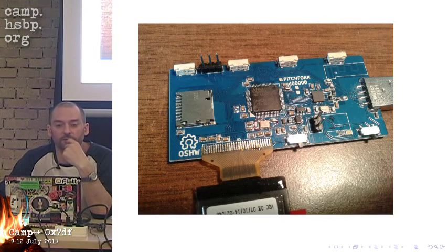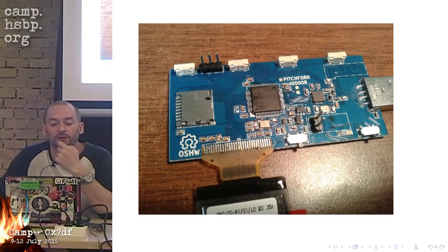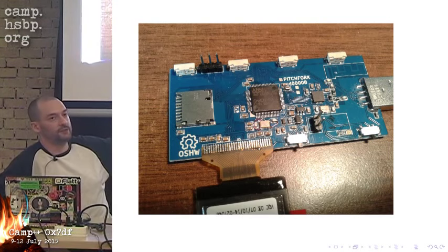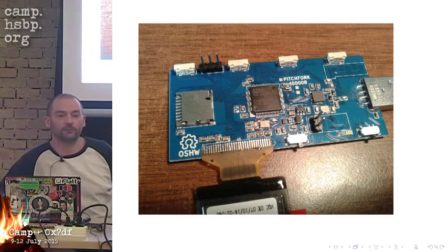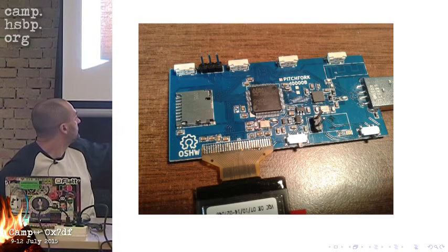After attaching all the remaining parts, this is how the board looks. In the lower part you can see the OLED display for the Pitchfork — this needs to be bent back. You can see the microSD card slot, the USB port, and the network power switch, which physically disconnects the network device. This is the network CPU chip, disconnected through this switch so you can be sure it cannot transmit anything — for example, cryptographic keys. And this is the main power switch.